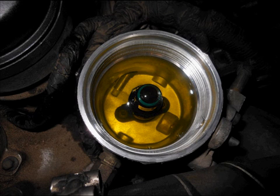Make sure there's no contamination at the bottom of this bowl. If there is contamination, this is the fuel coming from the conditioning module, so go back to the conditioning module. If there's any water or contamination coming to this point, it should have been removed already. Go back and correct the problem at the horizontal fuel conditioning module.